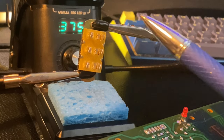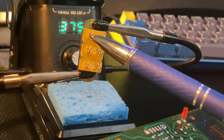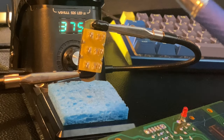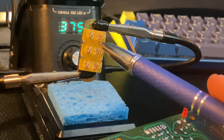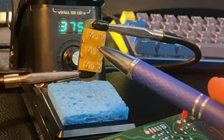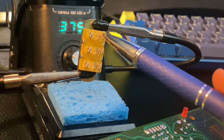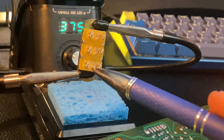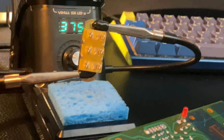All right, so check this out. This is a double pole switch. So we've got six tabs. We're going to call this three columns, two rows. So we're going to put the input here, and we're going to put where we're routing it here and here. So from the board here, from the speaker here, and from the jack here. But we're going to keep all the orange on one side and all the white on the other.